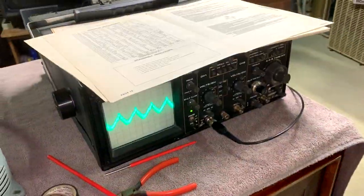That's what you have to do with the static magnets in the center — get them exactly like that. Because when you turn the convergence control, as you can see, they're just going to merge together. Now it's not perfect yet because I'm still working on dynamic convergence, which leads us to where I'm at now. I've got the oscilloscope here.